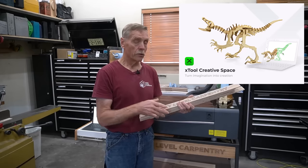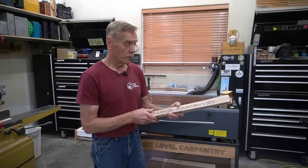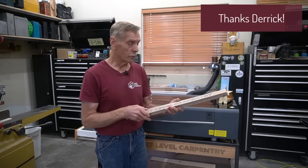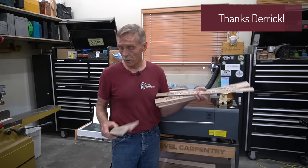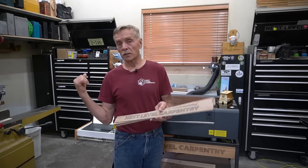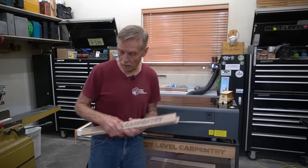And as it turns out, the Creative Space software is functional and it's accurate, but it's not as robust as Lightburn. And to get this text to look just the way I want it, I had to reach out to my friend Derek Lacey, who is a bit of a ninja with Lightburn software, and he helped create the bitmap file that I'll actually engrave on that piece, because there's some geeky little details that Creative Space won't do, but Derek was able to use his version of Lightburn to create a file, email it to me in SVG format, which the Creative Space software understands, and then I imported that image into this machine and that tablet so that I could program the power and speed settings so that the engraving would come out the way I want it,